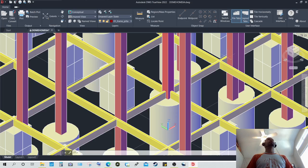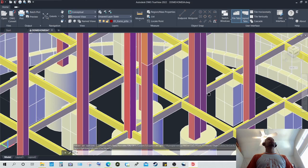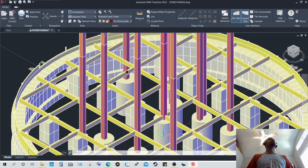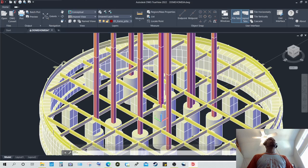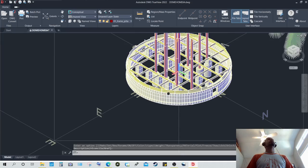There would be an attachment to that pillar or column right there via braces or straight bolts, bolting through it, of course boring it, drilling through it, and then bolting them. Those two columns appear that they could be secured to the floor for further support, not only for the floor but also for the columns themselves. If they're attached to other members that further stabilize it vertically, then that is always better than not. And a view from the other side will show some of those attachment points a bit better.